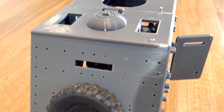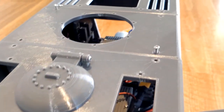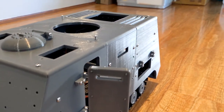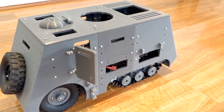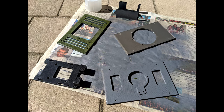As it stands at the moment, this is what's currently printed in PETG for the vehicle, highlighted in blue. There's a mixture of PETG on there — the top, the entry door and things like that are PETG — but all the underpinnings are still in PLA+. So I've got a lot of printing ahead of me to redo this vehicle in PETG. The thing with PETG though is it's very hard to sand and it really doesn't like paint either — that's a disadvantage. But otherwise it seems to be holding up in the sun just fine, at least for the bigger parts.